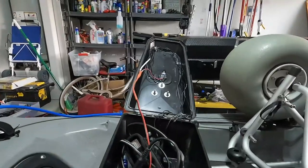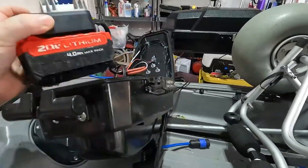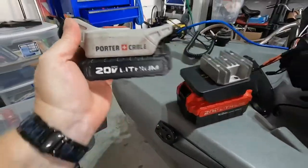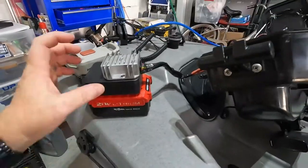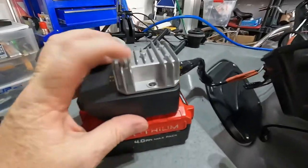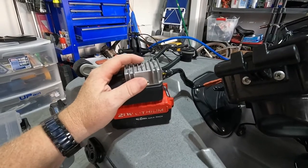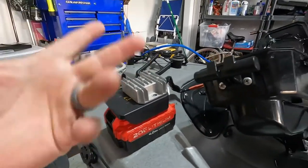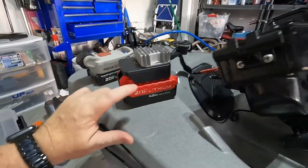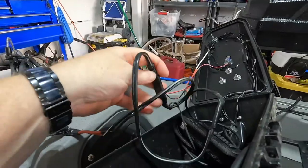I know you've already seen the lights hanging off the back of this thing. I took — you can use just about any kind of battery — but I have these Porter Cable 20-volt batteries. I bought this adapter on Amazon, and then this is a step-down voltage converter. It's not a whole lot of amps, but it's way more than what I'm doing here. You just pop in your lithium battery, and I've got it wired to an SAE connector.